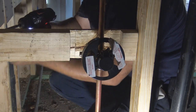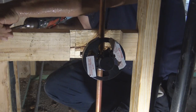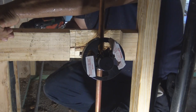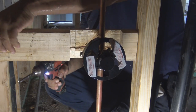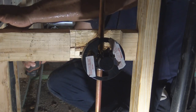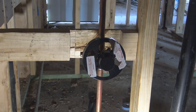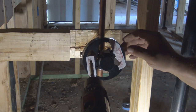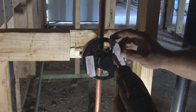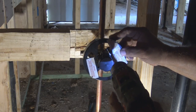And also, tubs come in right hand and left hand. I ran into quite a few people that went out and bought a left hand tub, not understanding that there is a left and a right hand tub, only to get it to their house to find out they have the wrong tub. So keep that in mind, that if you're going to do any renovation, know if you have a left or right hand tub. If I was facing the tub and the cutoff valve was to my right hand, that would indicate that is a right hand tub, vice versa to the left.